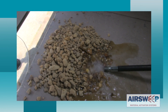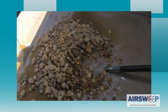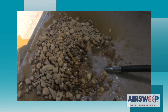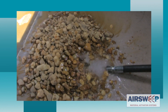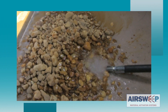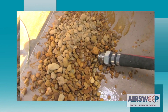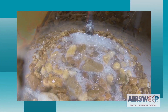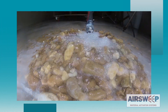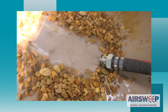This river gravel has a bulk density of about a hundred pounds per cubic foot, so it doesn't move too easily. You can see that the force of water coming out of the three-quarter inch hose isn't doing too much to disturb the pile. Now the volume of water has been quadrupled in this inch-and-a-half pipe, so the force is also really increased and it easily displaces the stones.